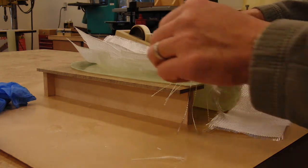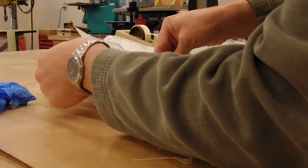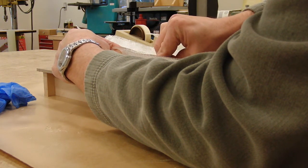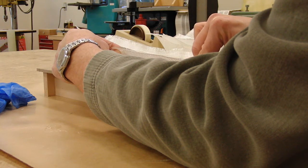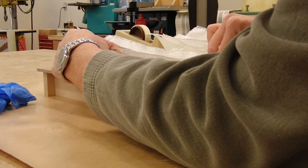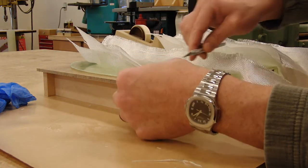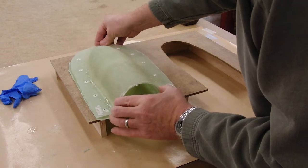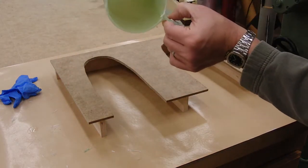With a sharp knife, you should be able to cut off the excess by holding it such that the blade is parallel to and flat against the lip. This is why the leather stage is so key — if we waited until full cure, not only would we have trouble joining the two halves and getting a chemical bond, but we'd have to saw the excess off. Cut all the way around the half for a nice clean edge. Once the pieces have been trimmed, we can test fit the mold. You can use the holes that we drilled to line it up, make sure it'll close. And there's how the two pieces will fit together.